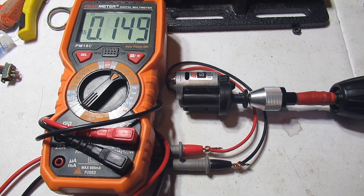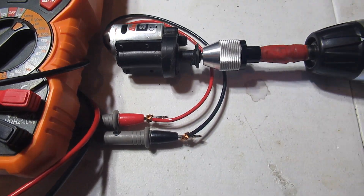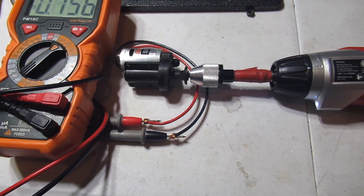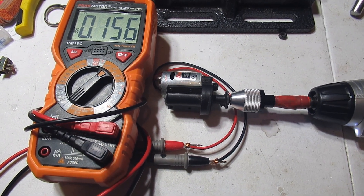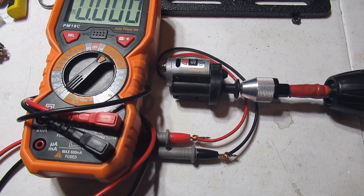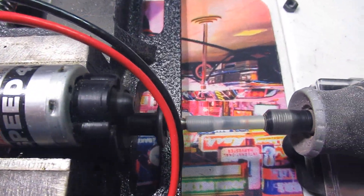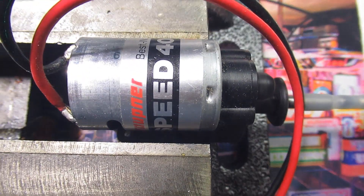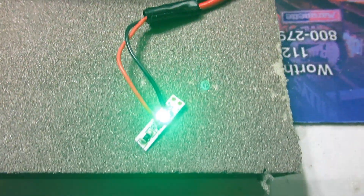I took my small battery-powered drill just to find out if it was producing enough electricity to light an LED. This drill turns really slow, about 100 RPM, but I was able to find out which terminal was plus and minus and hooked it up to the LED. Then I spun my Dremel tool on position 2 and it easily pumped out 4 volts at about 1200 RPM, and this lit the LED quite nicely.